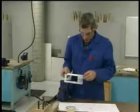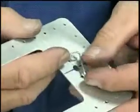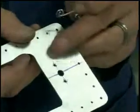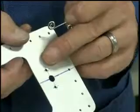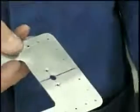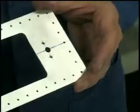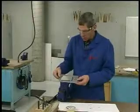I've laid out locations for the access for the spring, measuring the dimension of the spring between the rivet holes and transferring that to my doubler with a line drawn straight through that Dzus hole, and I've countersunk those two holes on the top side. So the doubler top side is identified because it still has that center line on it. You want to make sure you don't countersink or dimple the wrong side of the doubler. So make sure you mark the top side of the doubler.